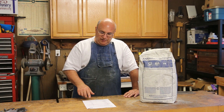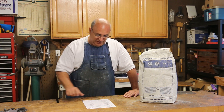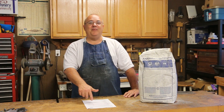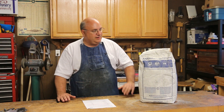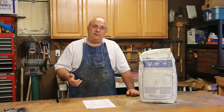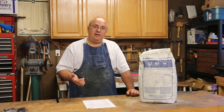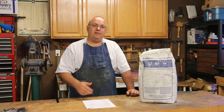The name of this particular product is Express 30 Plus, and it is rated to go up to 3000 degrees Fahrenheit — about 1650 degrees Celsius for you metric folks. That's more than enough to do what I want to do with this furnace. I plan on using it mostly for brass and aluminum, but I may attempt cast iron at some point, so I wanted to build it to withstand those temperatures, and this should do it.